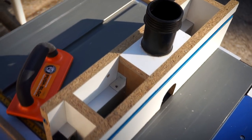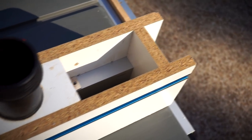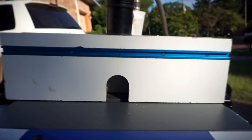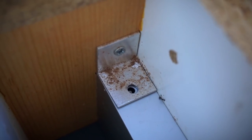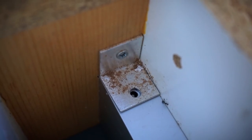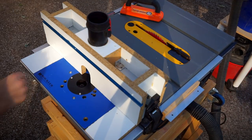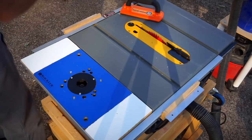The fence head-on is pretty simple — it's got a cutout in the middle and it's boxed in right there to allow the vacuum port to extract chips through the mouse hole. I cut a slot or dado on the top of both sides to accept Rockler's t-track, which is awesome for holding jigs, stop blocks, or feather boards. I also drilled and tapped holes in the top of the fence to hold down an auxiliary fence if needed.